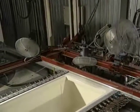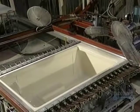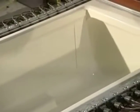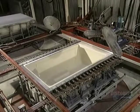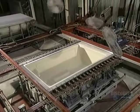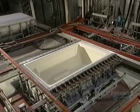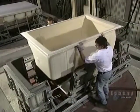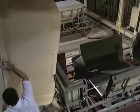The mold must cool before it can be opened. Powerful ventilators blow air directly onto the mold, lowering the temperature to 77 degrees in 4 to 6 minutes. The ventilators are then withdrawn. The shell is then easily removed from the mold, and that's because it weighs a mere 16 kilos.